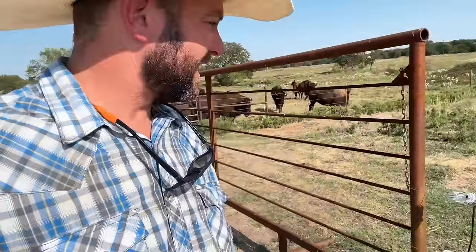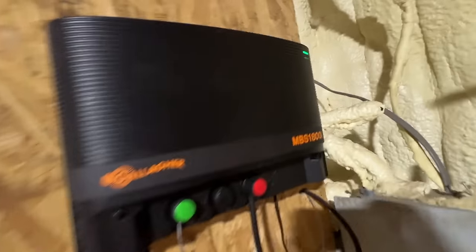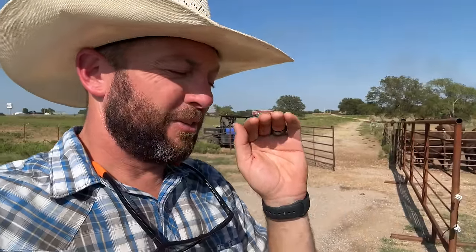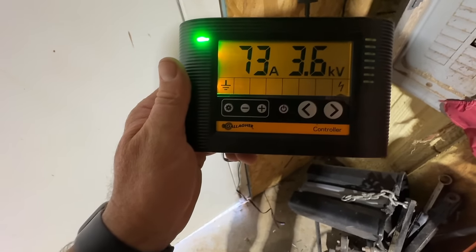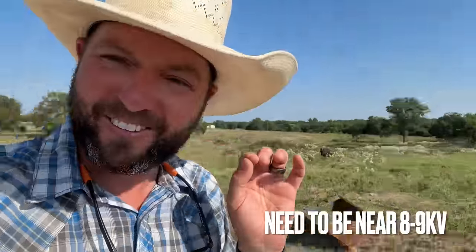We still are going to use some of our existing cross fences, right, that we already have, barbed wire. But places like this, what I've done is our energizer is up at the barn, way up there. It's coming out at like 6,000 volts. All right, and I know it scares some of you, like, holy, you're gonna kill him. No, no, no, no. So basically, if some of you know about that, I need some help here. I just drove three more ground rods. So I've got six ground rods in, and I did get more power. But the problem is, the further away that we're getting from the energizer, the lower our voltage is. Now it's gonna give them a little pep talk whenever they come up and touch it.